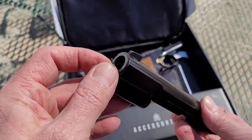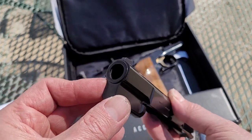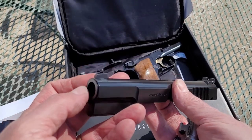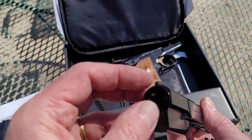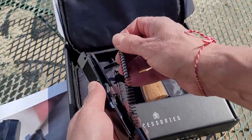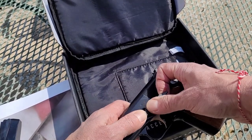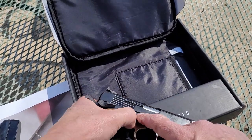Springfield did something a little different here. This is actually the barrel slide guide or barrel bushing. In the original design made in Belgium, this is a pressed-in part and soldered to be somewhat permanent. This one appears, from what we're able to see and tell so far, to be a threaded barrel bushing that is screwed in. And what that ugly stuff was you saw in the picture — that is something coming out of the threads after an acetone bath. Before we do a refinish, all residual oils and greases in the steel and in and around that barrel bushing, also in and around that locking lug cam, need to be removed.